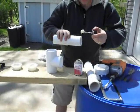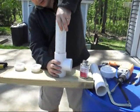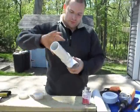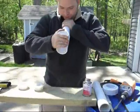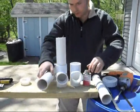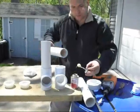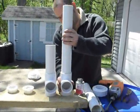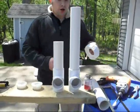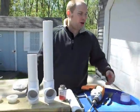I'm going to go ahead and glue these parts in using PVC cement. With the PVC cement, you'll go all the way around your pipe, and then you'll put it in here and twist it as you push down. This will make the cement be even around the fitting. So there's one. Now you continue gluing on all of your pieces. I'll continue to do that off camera, and I'll be right back and show you when it's all put together.